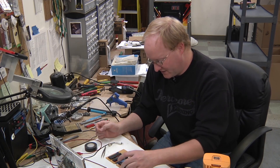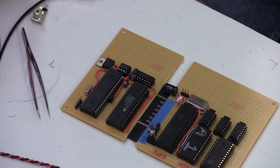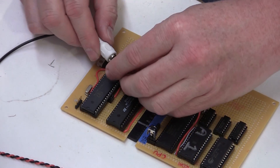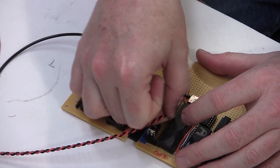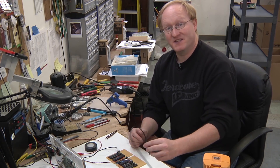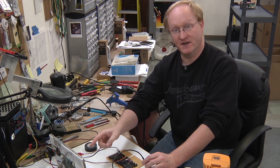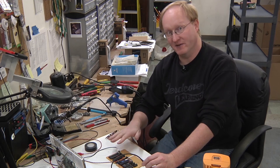So this should work — only one way to find out. I'm going to hook it up. I've added a composite video port here, which I'm going to hook up to this display, and we have 5 volts coming in here. I'll need both my power supplies. We don't have the keyboard yet, but we can send it serial characters from my terminal, so we'll see the output on the screen and give it characters from my laptop until we get the keyboard attached.